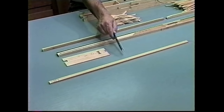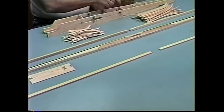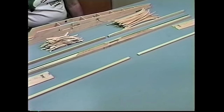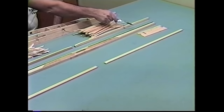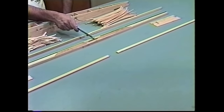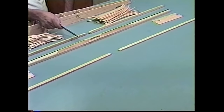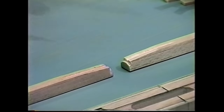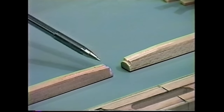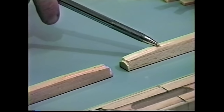I prefer to make my leading edges from AB grain balsa. The fixturing method of the I-beam wing requires that these pieces be a consistent width along their length. The core piece of the I-beam spar is cut from quarter or C-grain balsa. The top caps are made from AB grain, and as mentioned before, the doublers are made from 1/16 inch thick plywood. The trailing edge pieces are flatted for the control horn. Remember, this is a swept forward trailing edge design, and these flats will become a straight line when assembled. They are also grooved to accept the wire.